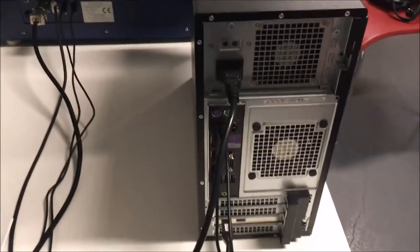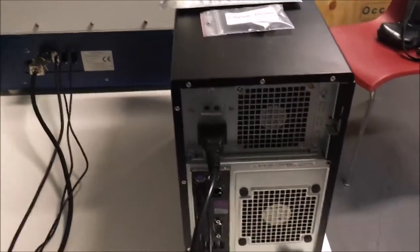So that's it. Now I will install the screen, the keyboard and the mouse, but I have to turn the computer, so I will stop the movie to just install the mouse and the screen. For the screen you have a cable where one part is HDMI, and the other one is to put on the screen, and this one is on the computer. So you put the HDMI on the correct plug. It's written, so just in the right sense.